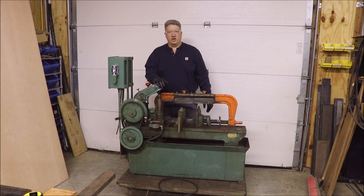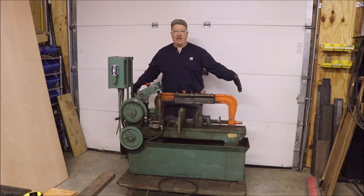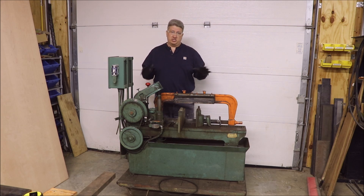So I wanted to talk to you about this Racine Power Hacksaw. This is a model 816W2, which means it is an 8 inch tall by 16 inch wide cutting capacity, so it's a pretty decent size saw. Very similar to a lot of the band saws that are available but with about half the footprint. This particular one, as usual for me, is broken - I've got to fix it before I can use it, hopefully it's not too major. These are well thought of saws. It's a hydraulic feed saw so it's got some nice features on it for speedy cutting. It's actually rated at cuts faster than a lot of the smaller size similar 1016 - which is 10 inch by 16 inch size - band saws.